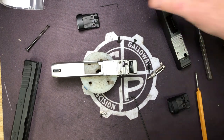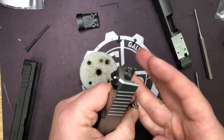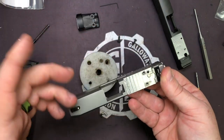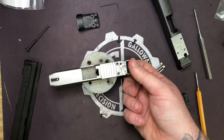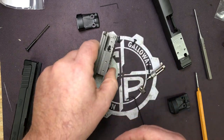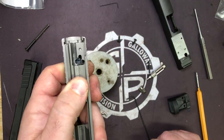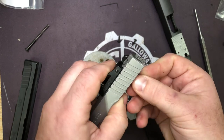What would happen is with the way the blocker sat on this particular pistol, it would hit the optic. So on top of the blocker hitting, you've got the spring pressure. On all the Kahrs that come through, I put in our reduced power blocker spring as part of the milling - that's all you need. Rather than trim coils or any of that, we just swap out the spring. It works perfectly. It still has to be fitted so it's not hitting the bottom of the optic. So if you pull your gun apart, flip it over, and you're looking at this and decide to email and insult my work - know what you're looking at first. That piece of tape is covering the optic, so we don't want the blocker bottoming into it.